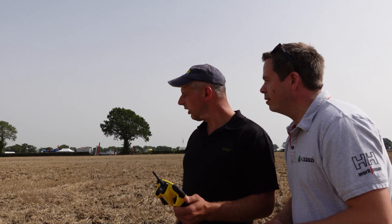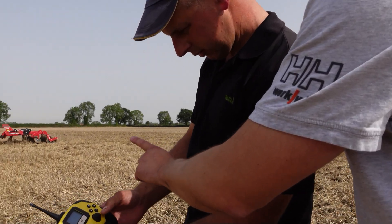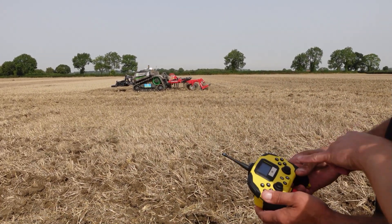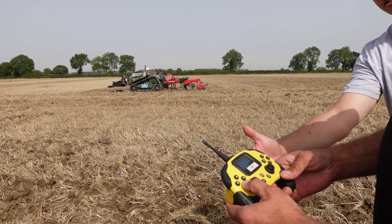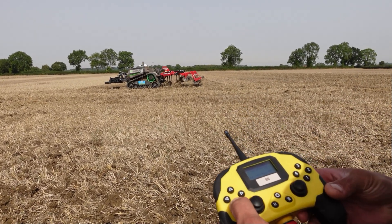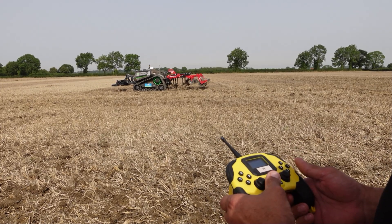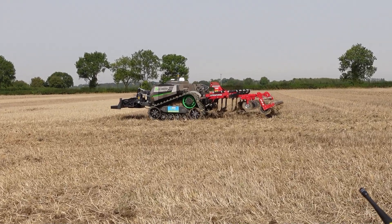So it's working in autonomous mode. To turn it into manual mode, just press number three. That's immediately stopped it - absolutely. So to lift the implement out of the ground, press and hold that button, and once you're holding it, use this button here. That's it, perfect. Try and use that button to drive it forward. That's the handbrake on - push that button, that takes the handbrake off. Left's come up, so that will now go forward. That's left and right presumably - give it a try.